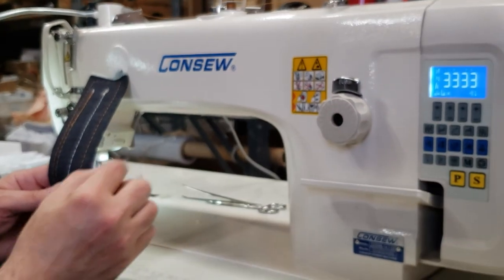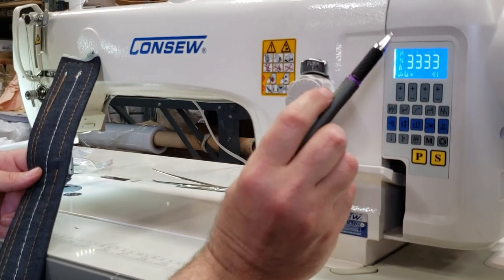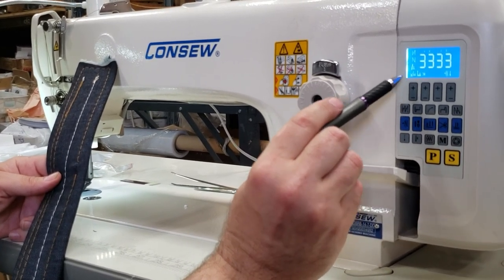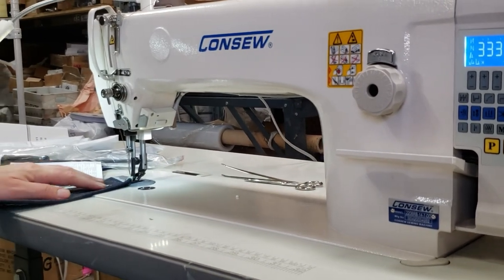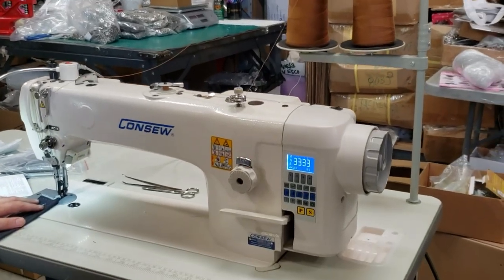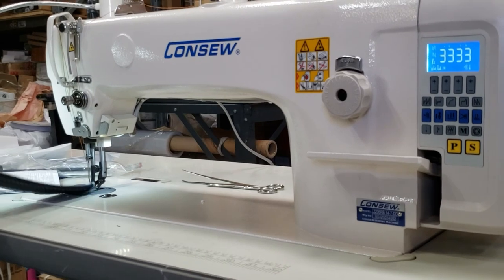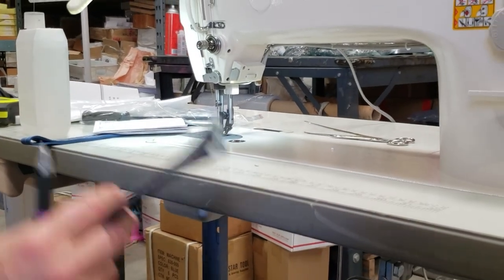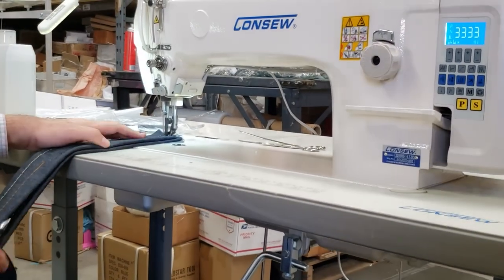You could do four, five, or six — and choose how many times back and forth. All these icons right here: you see this is a scissor icon for auto trim, here is needle-up position, and foot-up position meaning that when you stop sewing, the foot goes up automatically. I'm using a T105 thread polyester, but easily you could go double the amount with thicker nylon bonded thread — no problem. For vinyl, I'm doing one, two, three, four layers of denim. I'm going to go to number eight and start sewing.